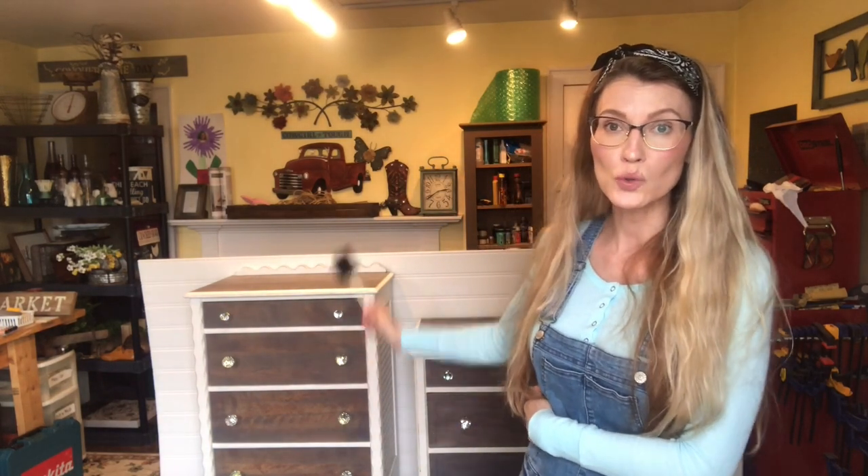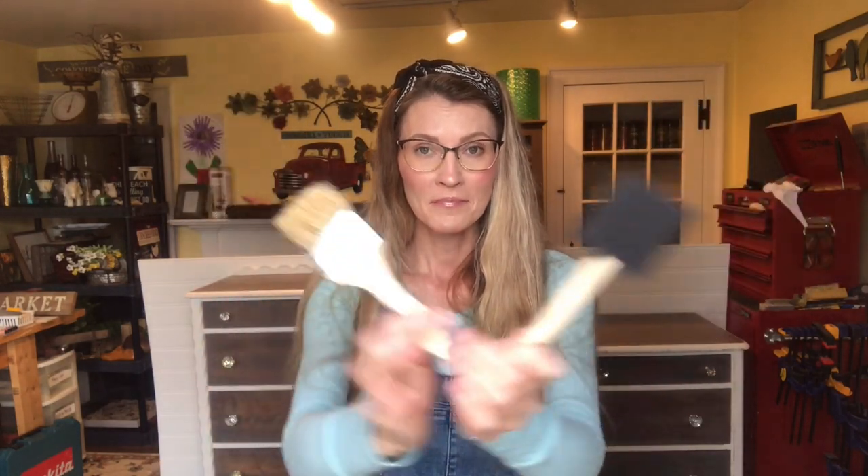Foam brushes — I love foam brushes and I go through a ton of these. I use them when I apply stain. I apply gray stain to the drawers and the tops of dressers, and I also use a two-inch foam brush to apply my top coat — my oil-based poly. No streaks as long as I sand between coats. I'll also use this to apply water-based polycrylic but I'll put a nylon booty over the brush. In my arsenal I always have chip brushes and foam brushes — you'll need them.